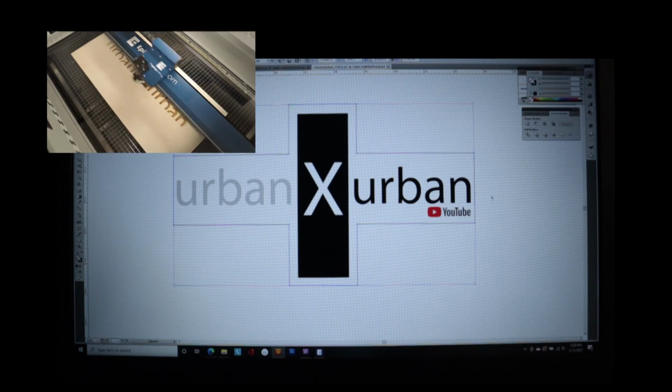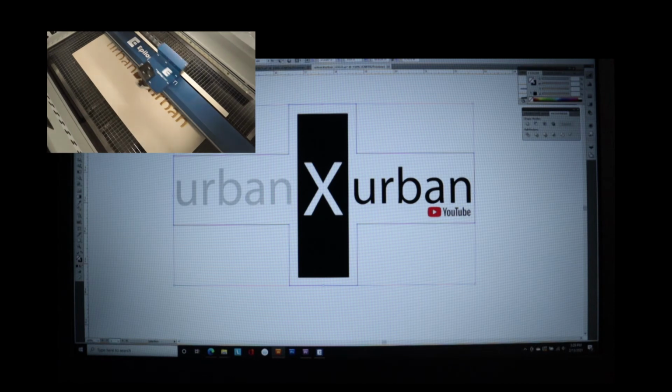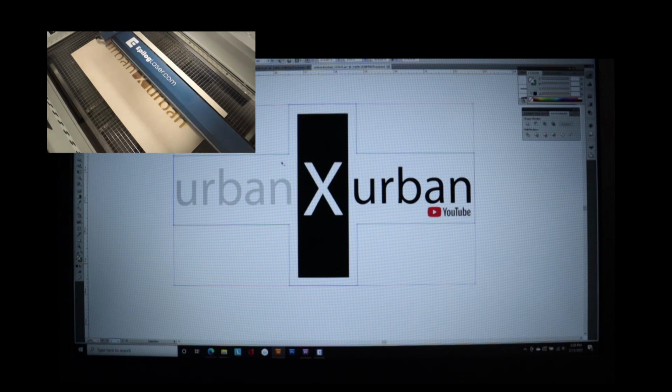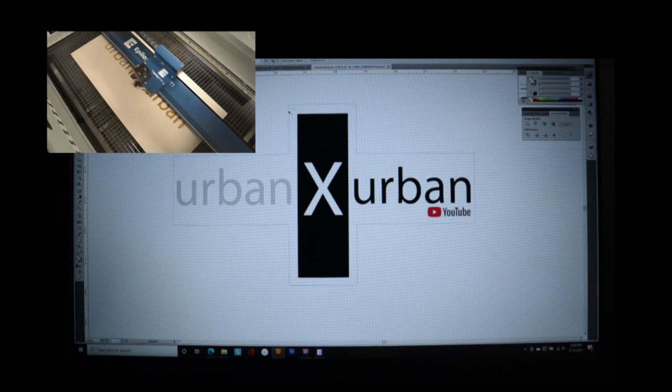Very important on this, I think all laser engravers, in order to show up as a cut line, first I like to change it just to red, because it could be any color. We can make it green actually because there's red on here, just so that we know that that's a cut line. And the most important thing is the stroke needs to be set to 0.025. Okay, so now the stroke is small, you can barely see it, and at 0.025, the software will know it as a cut line. So everything else is basically going to be engraved, and this will be a cut line.